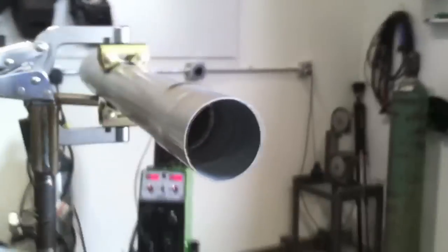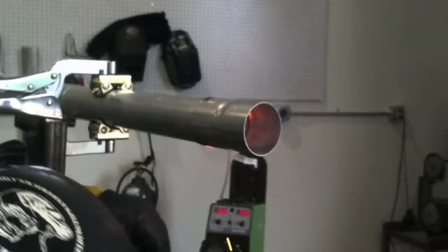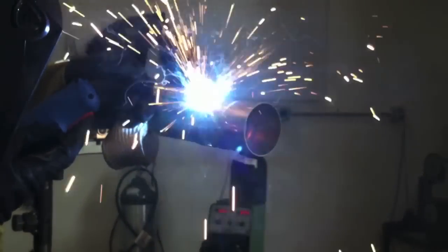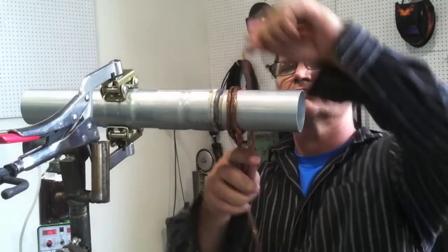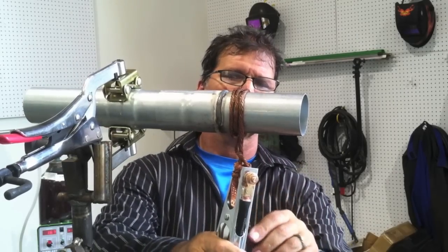It's not doing too badly. This material has a kind of zinc coating on it — not as heavy as a true galvanized steel, but you can see some flaky stuff on the inside so there's definitely a little zinc coating. It welds pretty well, it just looks a little brown on the outside when done. On smaller pipe like this you have to reposition your hands even more quickly to keep your gun angle good. Also, you need a good ground when welding exhaust pipe — it's usually nasty and you have to grind off a bare spot to get a decent ground. This chain-style clamp gives you a better ground with about a hundred little contact points instead of just a couple.